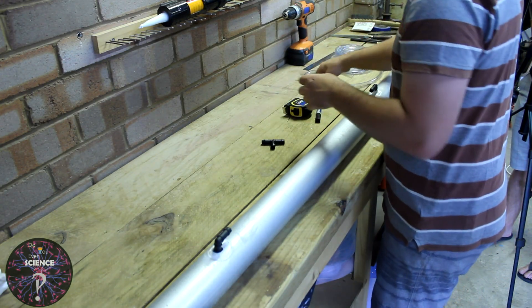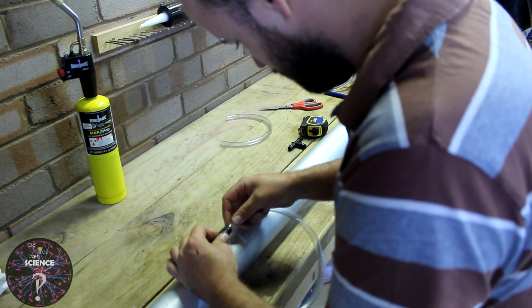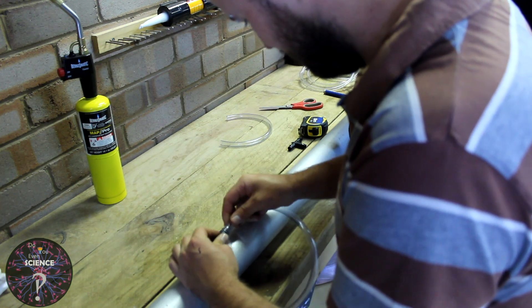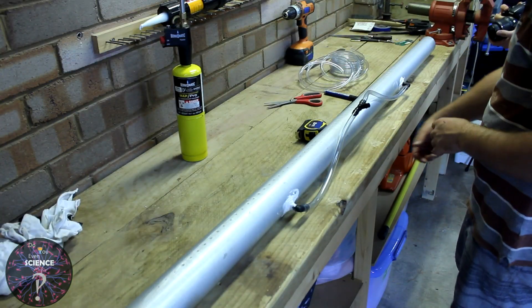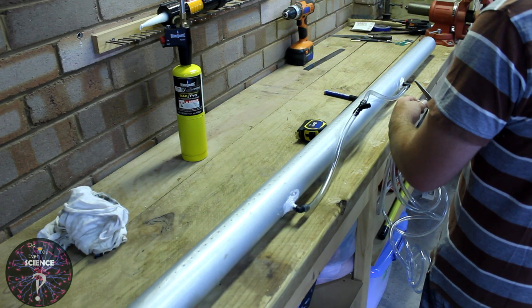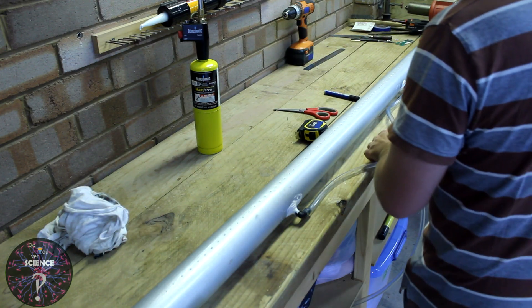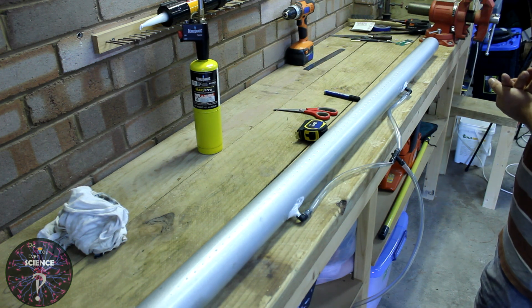This part is probably the most frustrating. Measuring half way between the two right angle barbs, cut a piece of pipe to the halfway length. Then try to put it onto the barb — I've found a blowtorch helps to loosen and soften the vinyl to allow you to thread it on. Once you've done that, do the same for the other end and then secure the T-piece in the middle as shown in the video. Then grab a nice length of leftover vinyl — two metres is probably plenty. Attach the two metre length of vinyl to the poly T. We now have two inlets going into the pipe, going into one main inlet. This gives us even gas distribution within the tube, avoiding the higher flames at one end that you may have seen in other Rubens tubes. This allows for a nice even flame and better standing waves.